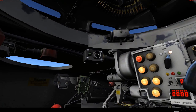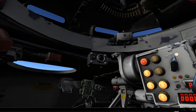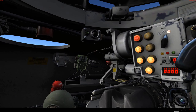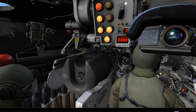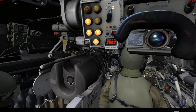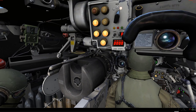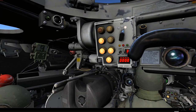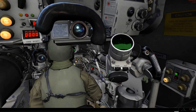This is a stabilizer deactivator. You hit this — the loader has one as well — and it deactivates the stabilization system for the gun. I am told that really by the time you get to the TTS, it's only used if you get a runaway gun. Such things do actually occur. We had one in one of my M1s — the Delta P had gone — and basically it sent the turret into an uncontrollable spin. So if you quickly hit this you have deactivated the stabilization and you can set about troubleshooting.